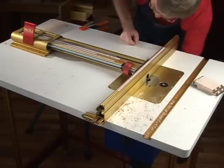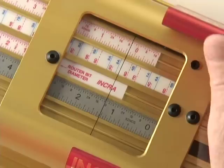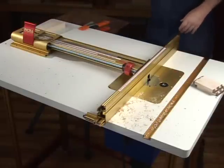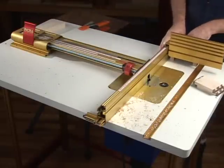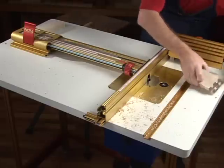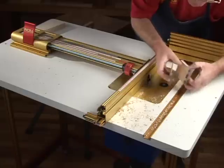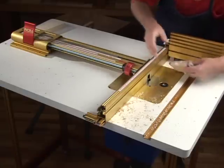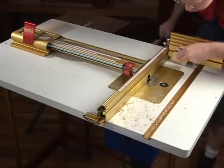After completing the rabbets, return the fence to the scoring pass position at zero. Clamp the right angle fixture to your fence and table, and place the two tailboards with the rabbets facing away from each other against the faceplate. Don't forget, pencil edges against the fence. Clamp the pieces securely with a wooden hand screw clamp.